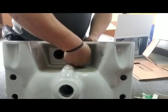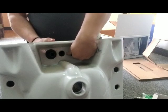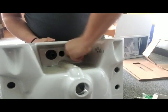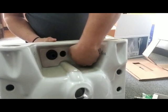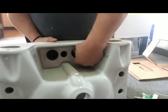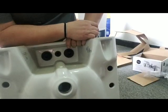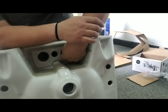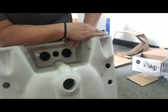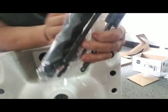There are situations where that's your only choice and you kind of have to, but when you don't have to — like in this case — you just put everything together. Once you've got those on hand tight, don't crank on them or you'll crack your porcelain sink. Now we're going to do your pop-up assembly.